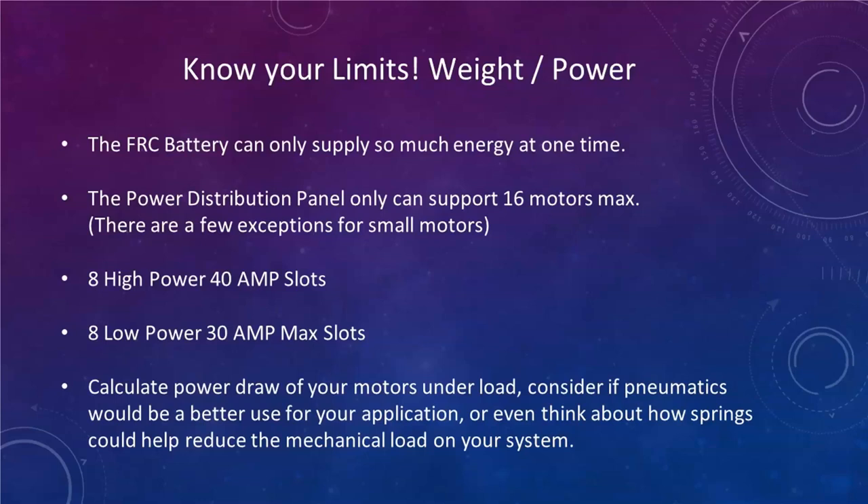The type of motor you want to use will be limited by how many slots you've filled. The JVN calculator can help you calculate the power draw of your motors under load, giving you theoretical current usage for a given weight or load application. It helps you figure out how much power your drivetrain and manipulators are drawing, and how much overhead you have left — or whether you'll be 'browning out' a part of your robot. If you're using too much power in one subsystem, it'll cause your drivetrain to drive a lot slower.